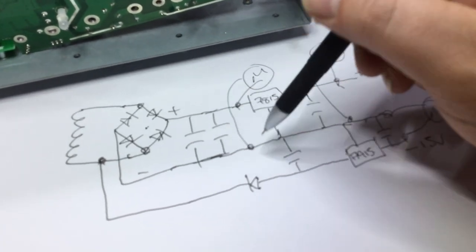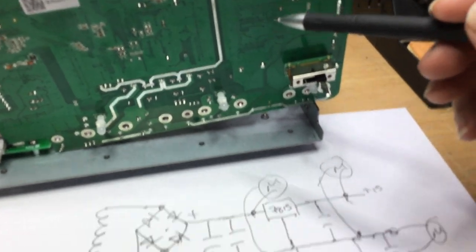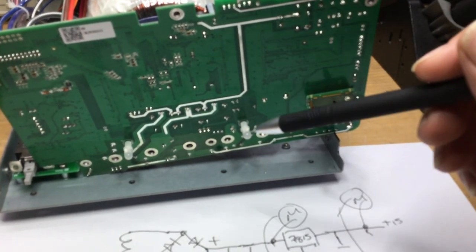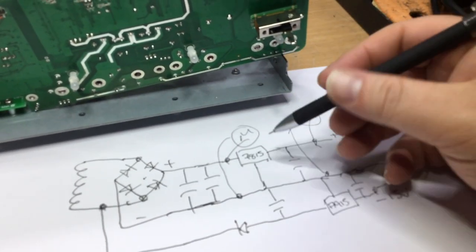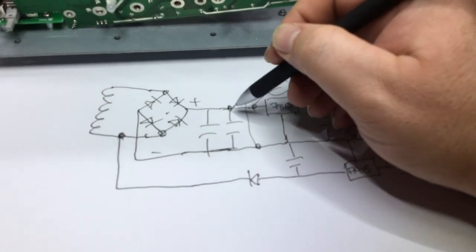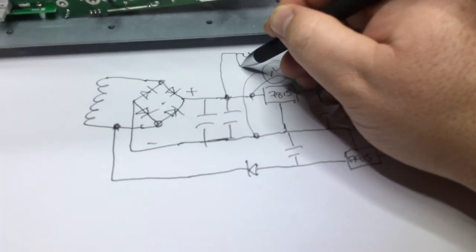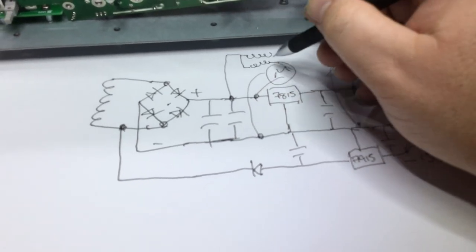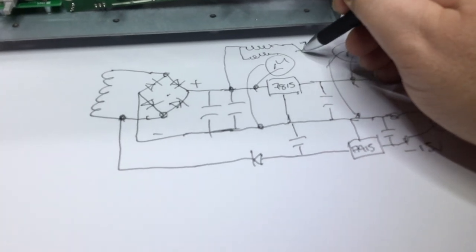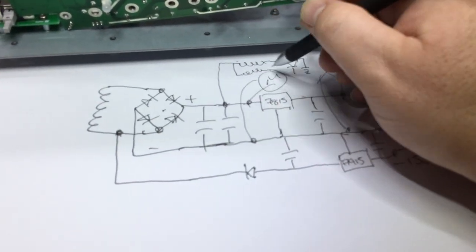I suspect that the easiest way I can solder on here is on this. This is that voltage output which goes straight off to what appears to be the relays. Now, I've not drawn it on here, so I'll do that. There's a tap going off just here, which goes off to the relay coils. So there's multiple relay coils in the system which are getting plus supply volts. Obviously each relay coil will be taken to ground using probably an NPN transistor to pull the relay contact in.